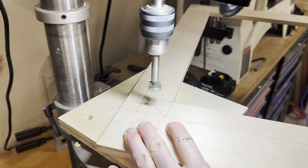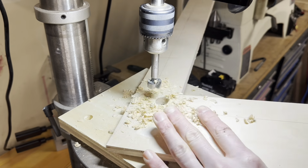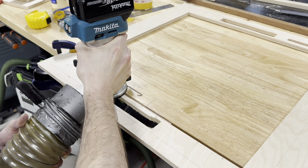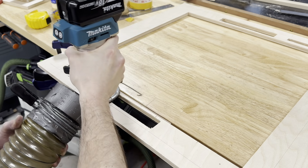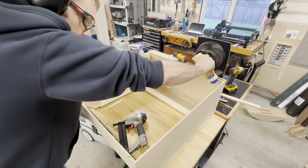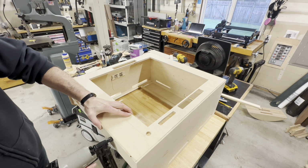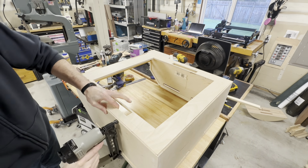I probably should have done this before I glued all the pieces together, but I still needed to add holes for the cords to go to the laser, a slot for the air assist tube, and 2 giant cutouts for the exhaust ducts. As an example of the usefulness of having a diode laser that can cut through 1/4 inch plywood, every single cutout that went into this enclosure was done with a laser cut template.